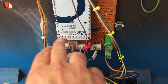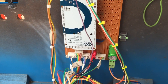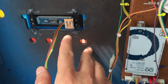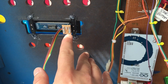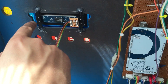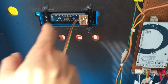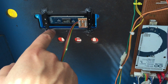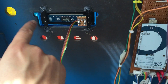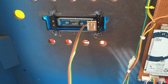It works now — it connects directly into the Arduino where you've got the internal pull-up resistor switched on, and that's just a common ground behind all the switches. This connector here goes off to the scoreboard, which is eight seven-segment displays with a custom 3D-printed bracket. A funny little issue was that the front glass is blue-tinted, and the red digits were invisible behind it, so I masked off an area and used rubbing alcohol to remove the tint, leaving a clear window with black foam around the edge.